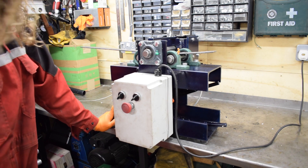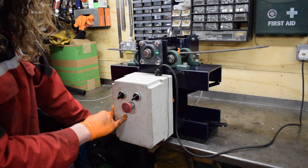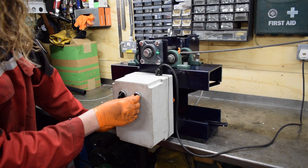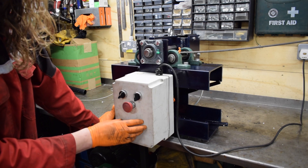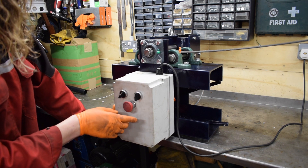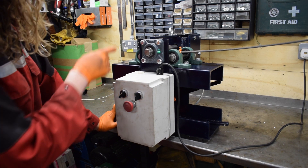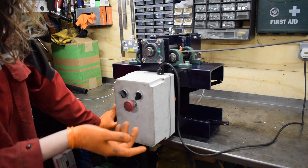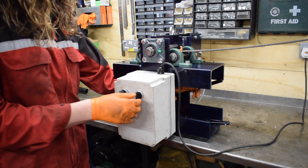That initial noise is because there are a couple of extra capacitors in there to fire up the motor — to run three-phase on single phase. The capacitors are wired in a way that effectively doubles the power to the motor on startup. What was found was that without doing it that way, you could easily stall the motor by hand — I tried it the other way and it was far too easy to stop. This way it's much better.